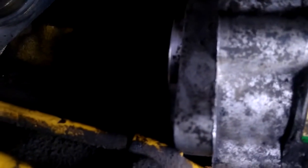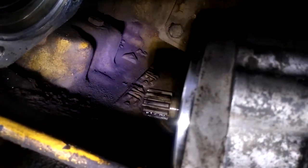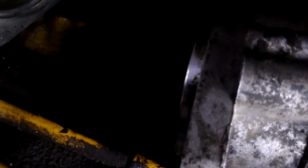What I found is: if you look up the part, it either comes with these little splines or it comes with an actual gear. Well, on the '03 International 5600 Cat 12, it comes with the little splines, as you can see. So what I did was back the bolts out just enough that I could slide it out without it coming off anything, and I looked inside and found that the splines are small — so I pulled it out and cleaned the gasket.